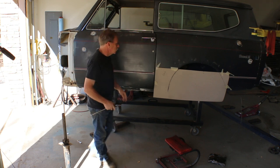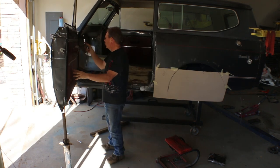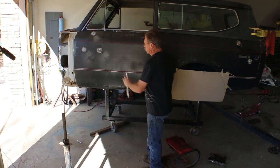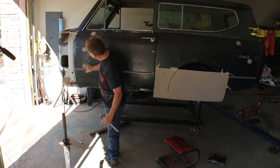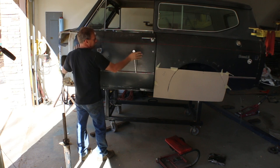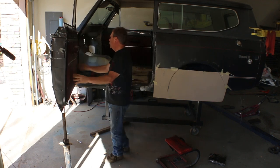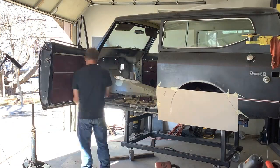So you use the top hinges to control how you fit on the quarter panel by moving them in opposite directions. And on the door, which I've got to remove this door panel to get to these, on the door side, the adjustment in there is how you move this door up and down, because in this case, these come back as straight panels or something similar, and we can move in and out and up and down with some diagonal. So let me get this door panel off so we can get to the other part of the hinge and get all our adjustments going on.